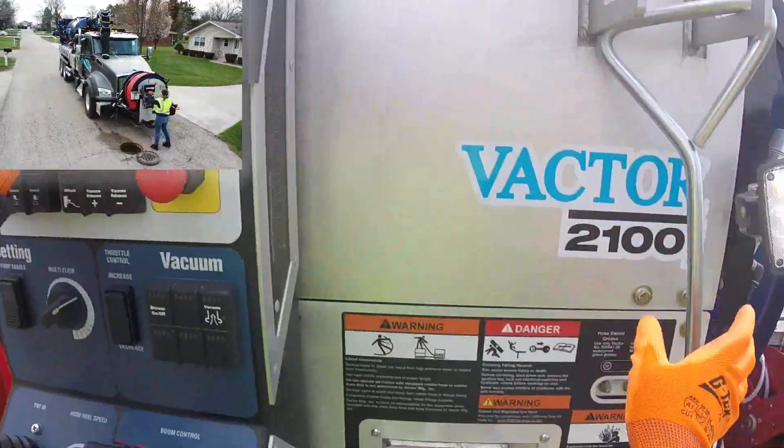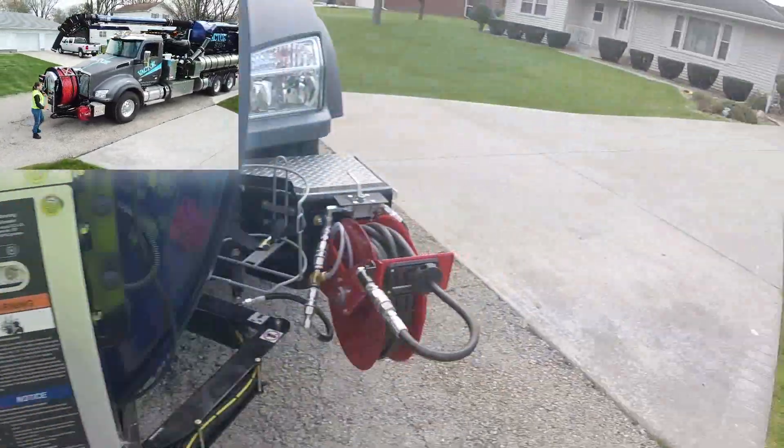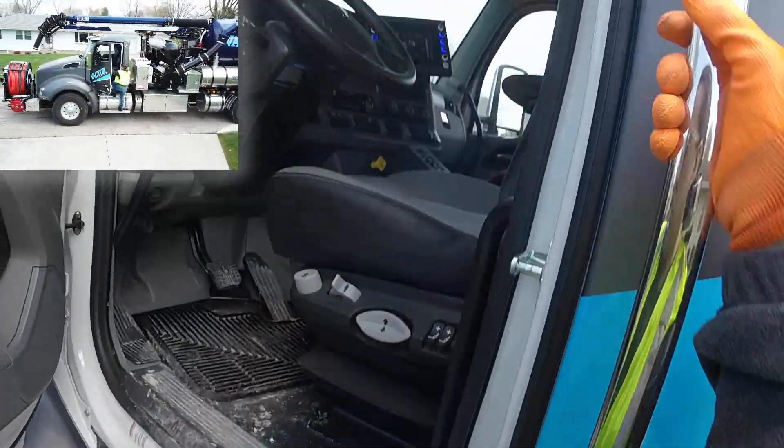The rod or hose can be managed hands-free by an indexing auto wind guide and a pinch roller to allow for smooth repeatable hose wrapping. The available halo system can also be used to allow for hands-free illumination of the hole.